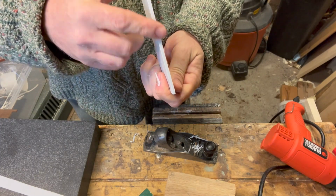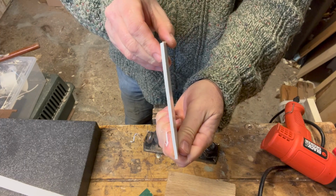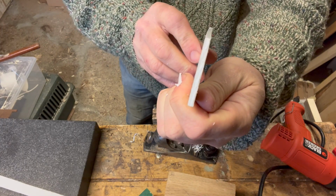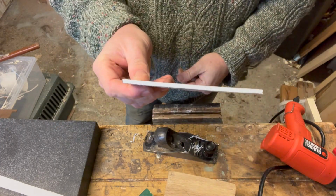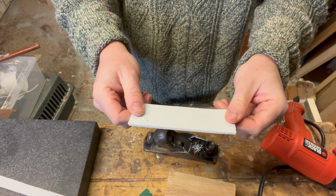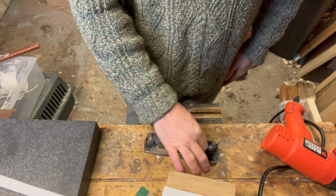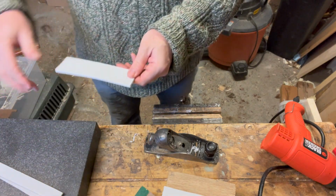Yeah, that looks pretty good. So what you can do is look at eye level on the edge, and then you can see it's really, really straight. And that's what you're looking for. Now that piece we can start measuring and marking to get our final dimensions, and then we'll cut it. So while I've got the plane out, I'm just going to put a flat edge on most of these pieces.